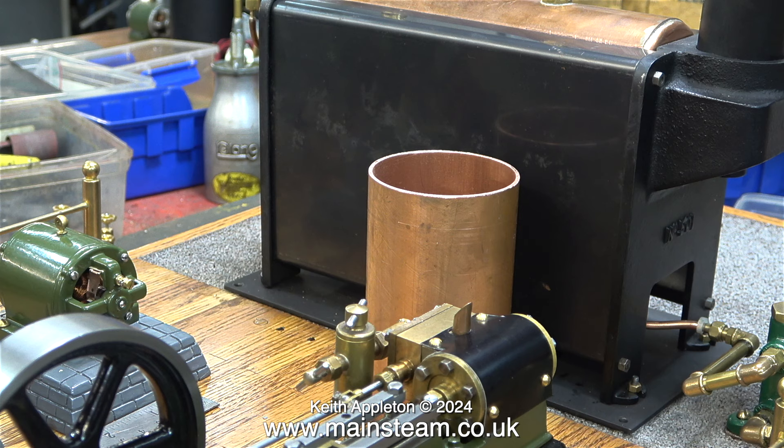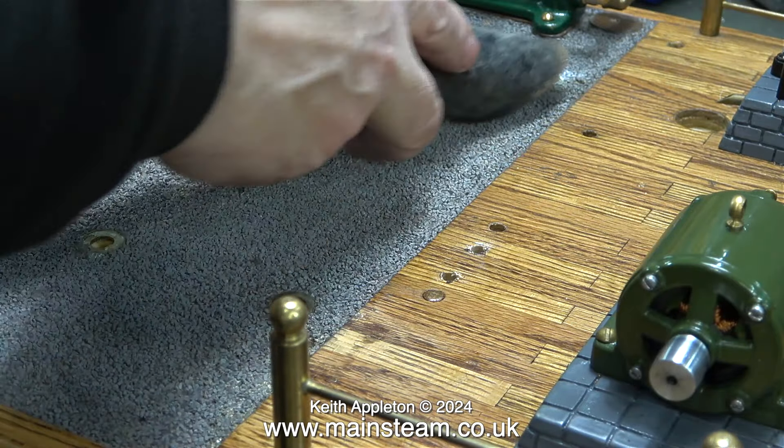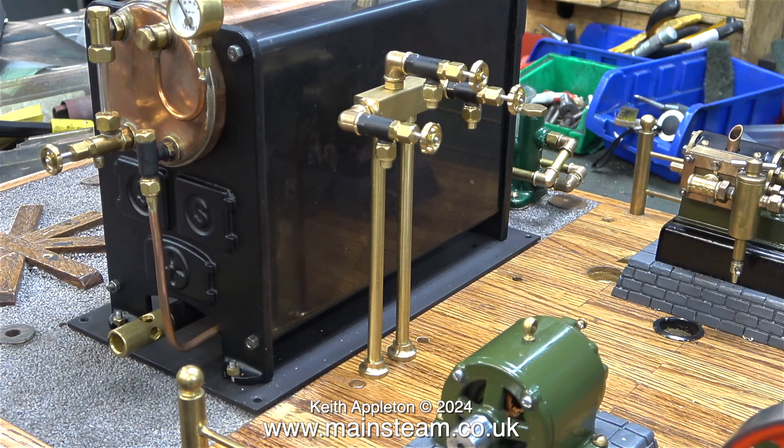Using my calibrated eye I've marked the positions to take a couple of bolts to hold the manifold in place on the baseboard. I'm checking my calibrated eye with a ruler and yes, it looks ok. It's always a good idea where possible to drill pilot holes — for that I'm using a 1/8th drill bit in my Proxxon motor tool, then drilling them clear and to size for 2BA. After making a mess all over the baseboard I thought it was a good idea to vacuum it away. I always keep my trusty Henry vacuum cleaner close to where I work, unfortunately I often forget to use it.